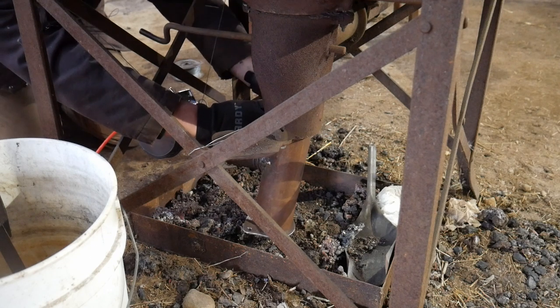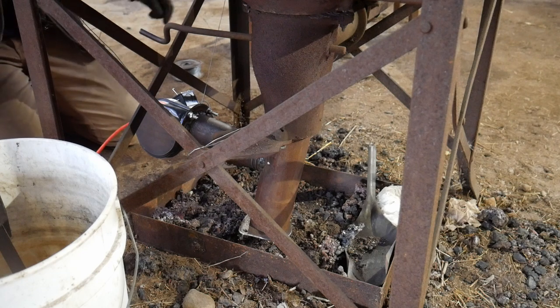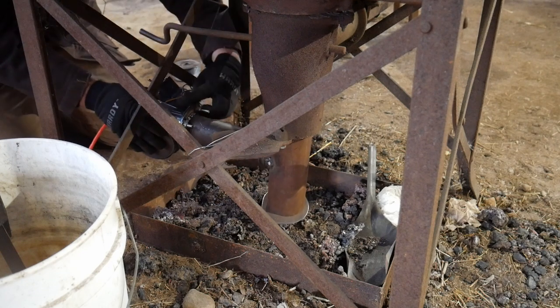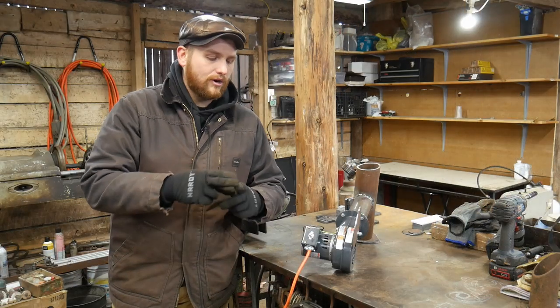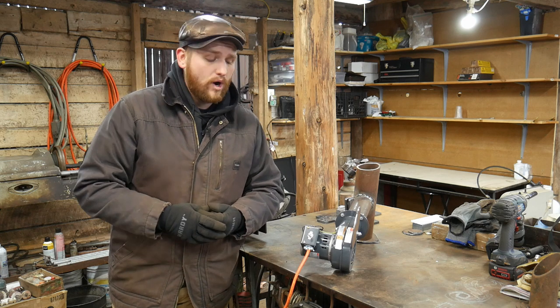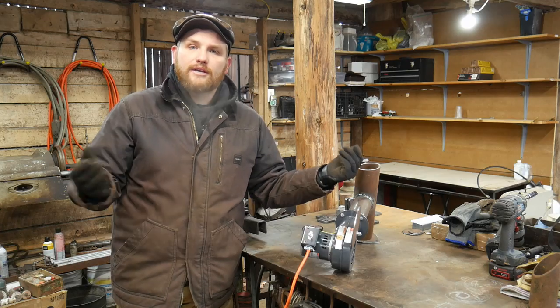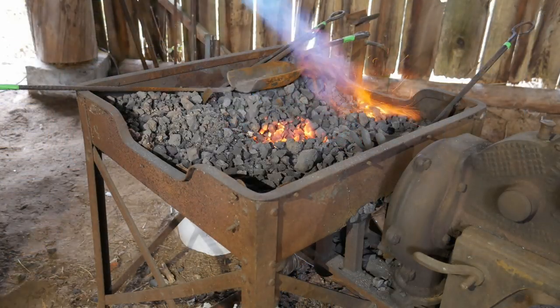I just took an extension cord and cut it and used the plug end of the extension cord like you would regularly. Then the female end of the extension cord, I cut that off and wired it into the box. Quick and easy, pretty cheap way of getting wiring as well. Again, a little on-off switch. Basic, you can find these. I think these are about $7.